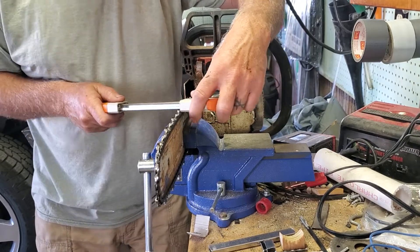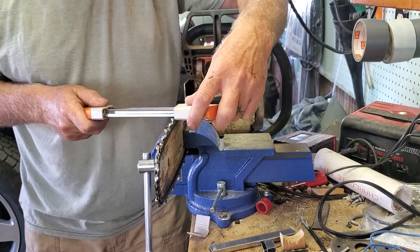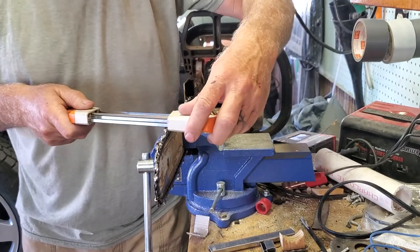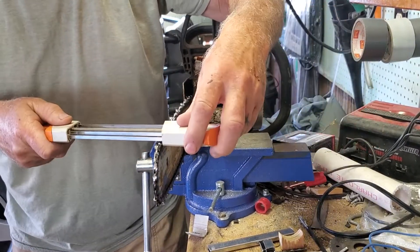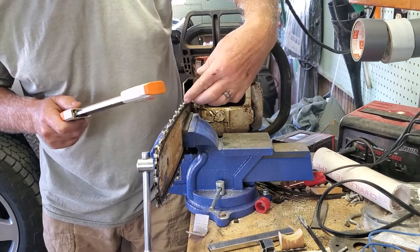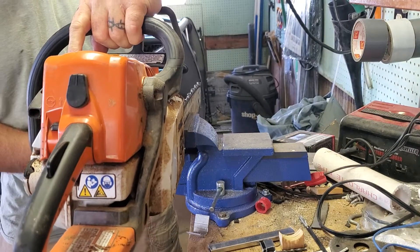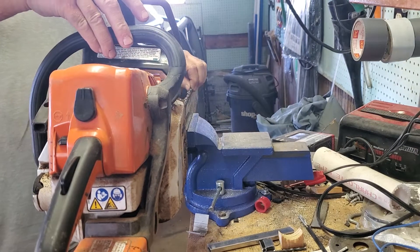You'll get a lot more out of your chain. This chain's expensive — I know I'm going to need them soon when I start cutting firewood. You really need a vice as well. When you clamp this in, make sure you're not hitting the bottom of the vice with your teeth and dragging them across it. You'll see when you get back to where you started — I already did a few.